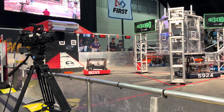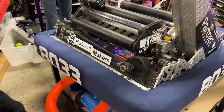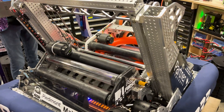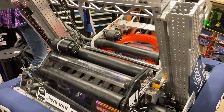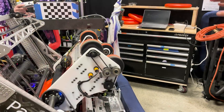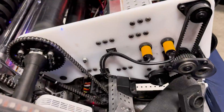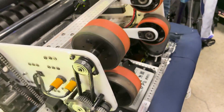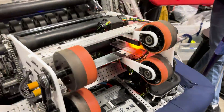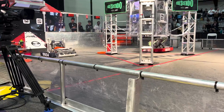When we want to shoot, we use the amp mechanism as part of our routing and pass the ring all the way through it. We can transfer after the fact if we want to, and once the ring is in the shooter we're able to aim up to any angle — for example our fixed feeder shot. We did split the two sides of the flywheels because we found in prototyping that having a small amount of spin is very advantageous for a stable shot, especially from long distance. It's been working out very well and we were happy to see that we kind of nailed the meta shooter in our prototyping.